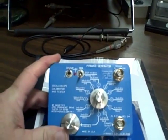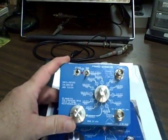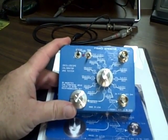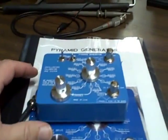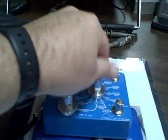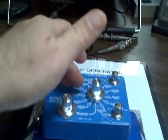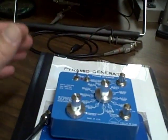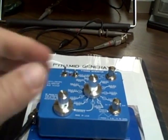This unit here is called the Pyramid Generator. It was invented and built by a gentleman out in California. I saw it on eBay roughly a year ago — as soon as I saw it I realized the potential of it, snatched it up, and I think I was his first buyer. What it does is it provides a frequency-selectable square wave, basically to match each of the ranges on my scope, but it also provides a pyramid output, which is essentially a triangle wave made up of square wave steps.